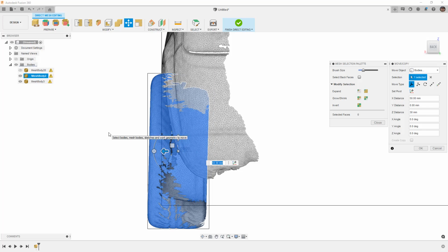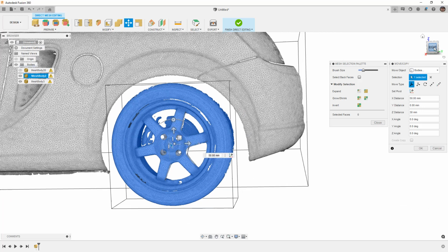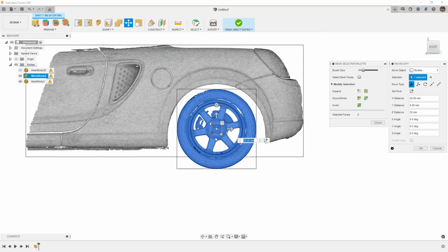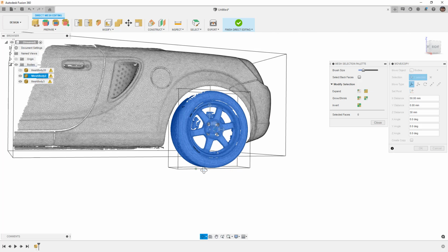Now, there are a couple of reasons why you would not want to do this. Having a deeper dish rim, on the rear, it's fine, it's okay, but it ends up being a bit worse for the steering axis. So if this was the front, we would want to be very careful not to just add a bunch of tire and rim outside of the mounting point. It messes with things like the scrub radius, and it's going to have some negative effects on how the car handles. So if you're doing this for handling, then be sure that you have a good understanding of the dynamics of your suspension. For this exercise, making a wide body, I don't think it's really going to matter, and this gives us a little bit more tire meat sticking outside of the stock fender.